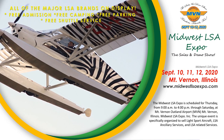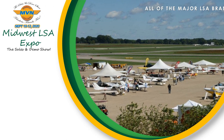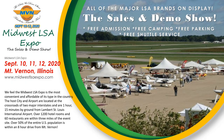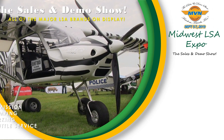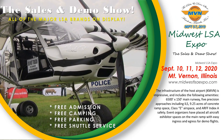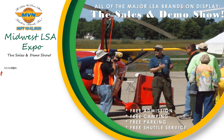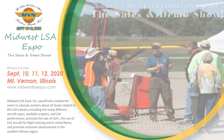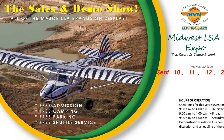So let's talk a little bit about how the airplane is made. First of all, some people might call this a simple construction. I'm looking right up above my head, and there's a series of large diameter aluminum tubes held together with gusset plates. That's basically the construction of most of this airplane. The fabric covering the wings is basically a sailplane type fabric. I think this would be called tri-lam, although there are different kinds of descriptions for the Dacron type fabric, and there are different brands for it as well. So it's a tri-lam like fabric.